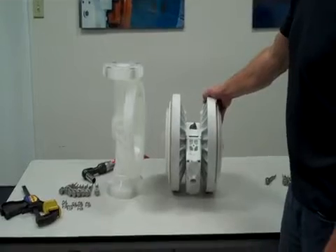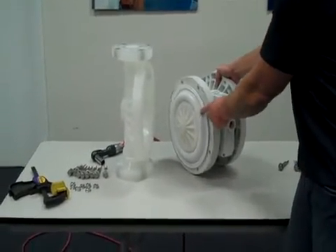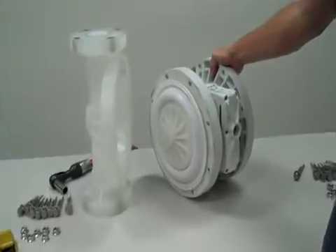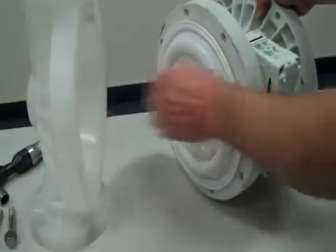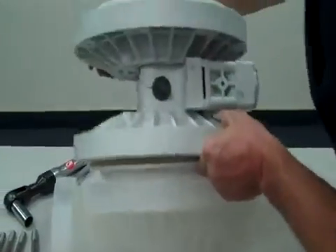What we have here is a plastic bolted P800 pump fitted with the new full-stroke Teflon diaphragm. One condition noted during assembly is a quite large gap with the center section simply placed on the liquid chamber. It was first thought to be a shaft issue, but it's actually the shape of this liquid chamber — it's a bit narrower than any of our other chambers.